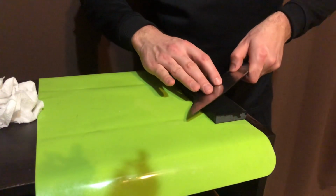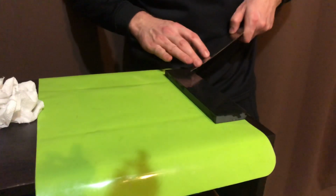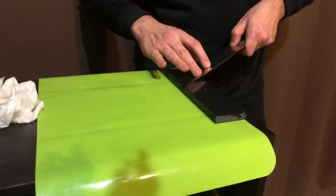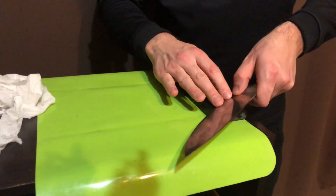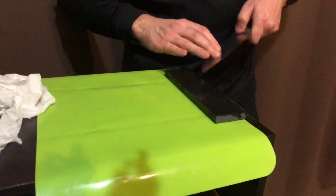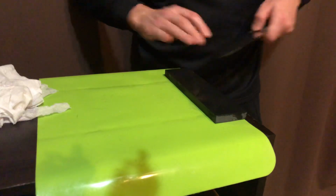And you do not need much pressure on the stone, just using the weight of the knife. The stone will do all the cutting. And it's just a beautiful stone, just jet black. I mean, what is not appealing about that? The one thing you will notice with an Arkansas stone, they are so hard. Because of their hardness, you'll find out if your technique is good or not on the stone. So you can feel every mistake with these. After this point, I'm just going to alternate strokes, and that will deburr the knife. And we should be pretty good.